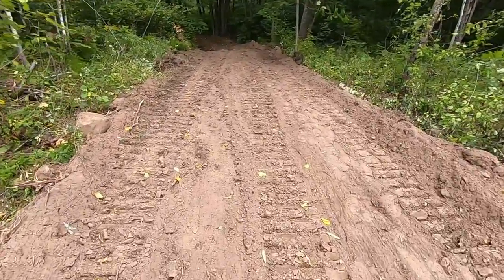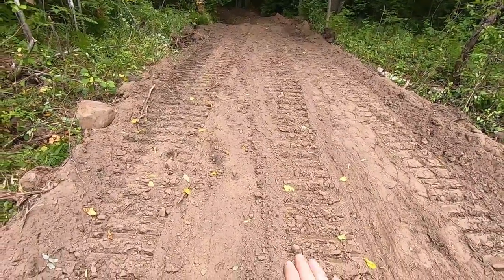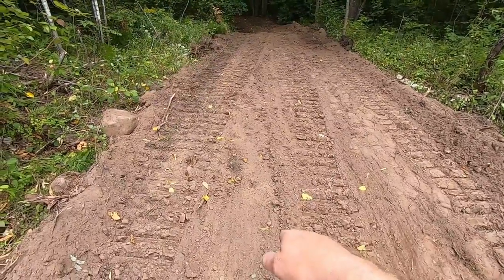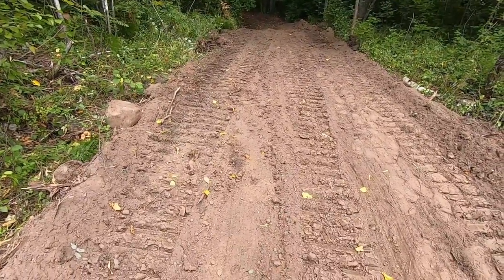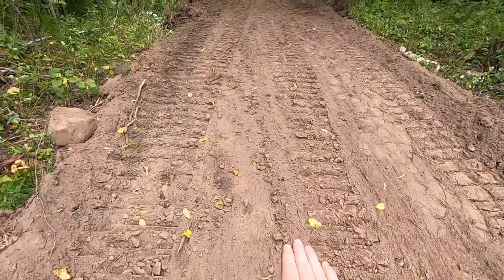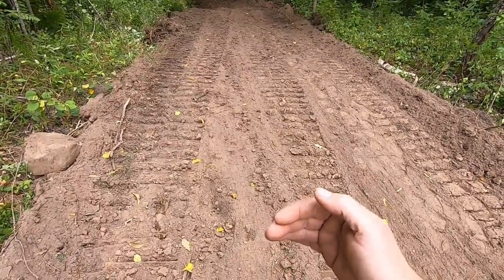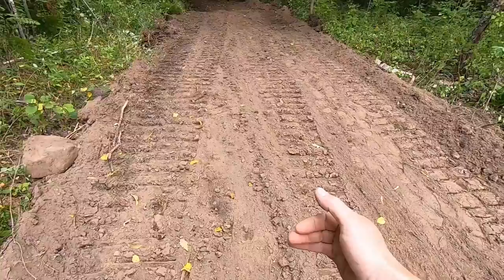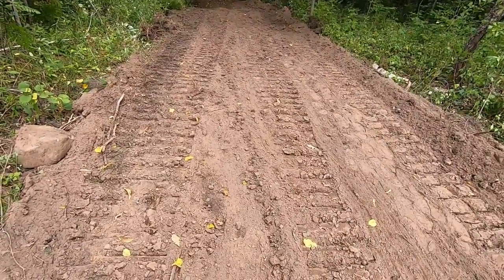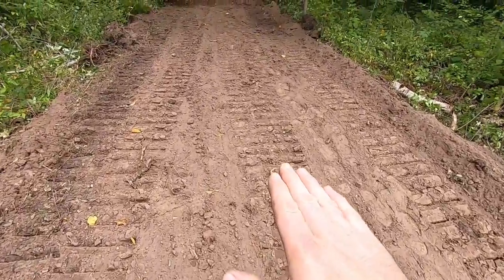And I have a little bit of a rise ahead of me. So since the blade is always out in front of the tracks, it's gonna encounter your change in elevation first. So what I'm gonna have to do to avoid digging the cutting edge in and potentially spinning out, stalling, losing traction, when I can feel that it just starts cutting a little harder on this rise, I'll lift the blade, I'll just creep it up a bit. My goal is to keep that cutting edge at ground level, not really dig at the ground, but not have it up so high that I'm spilling material underneath it and behind it. So I'll adjust for this little rise right here.